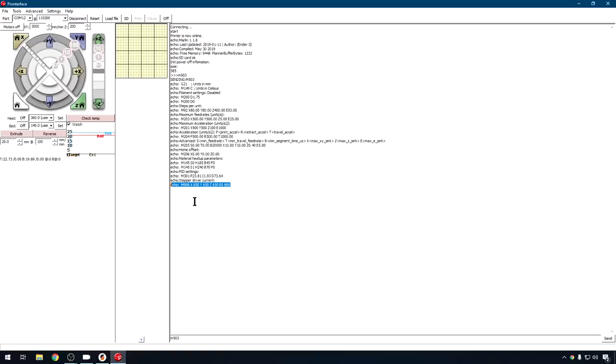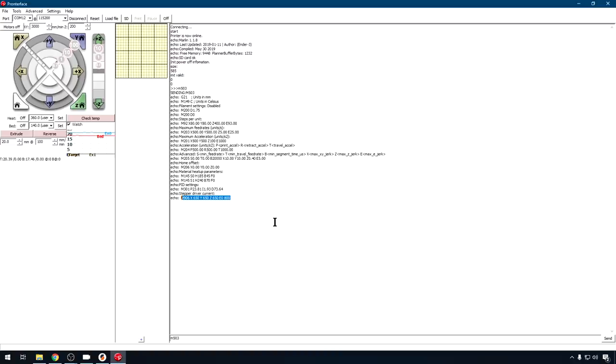M906 with X, Y, Z, or E0 will allow you to set the driver current right in the firmware from the command line, which can be a really handy feature. These defaults should be good for now. I've looked around on the Creality GitHub and I can't find a version of Marlin that utilizes this board - all these boards should be configured as a MELZI, but you'll need one that allows you to configure those 2208s to be controlled by UART mode. Creality also states these boards have bootloaders, so you don't have to flash that separately if you're trying to upgrade to Marlin.